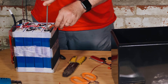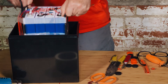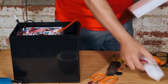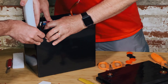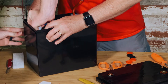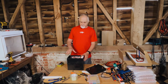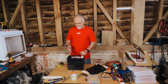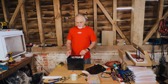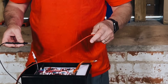We made the red wire going to the red terminal on the case lid and put that in. That's pretty much the battery built and ready — we just need to turn the BMS on, put it back in the case, connect everything up and measure things. We got some foam that came with the cells and used that padding just for this prototype to keep things secure. We've finished the basic build — taped everything together with the experimental ply ends, put it into the case with padding, and installed all the balance leads. In theory it's not switched on yet — we still need to switch the BMS on.